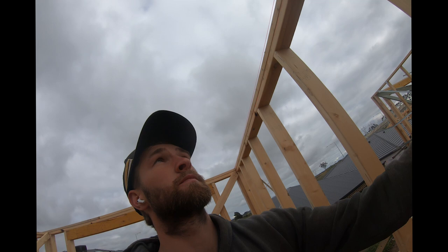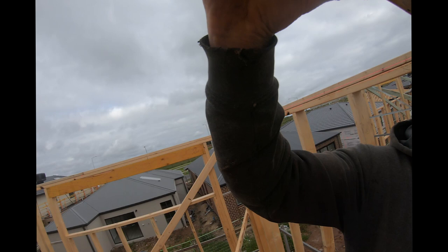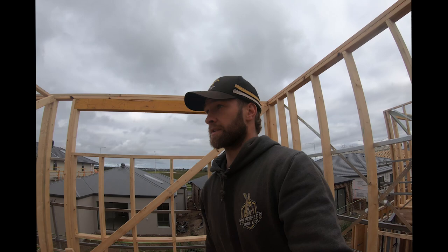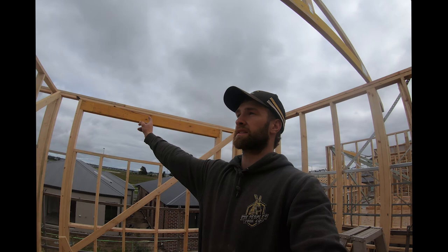The other thing that's pretty important to do at this stage before you fill up your girder truss is to check it's straight as well. On a little truss like this, you're just able to eye it, and you should get it pretty good. On bigger trusses, you've got a string line. If you're on a 12, 14 meter truss, it's nothing to have 100 mil in the middle of it, and it just messes everything up, because then obviously these are 100 mil too far that way. Just string line your girder truss if it's not already straight. And then you'll pin a block to a length to that wall and hold it straight on here where you need it. So we do that one.